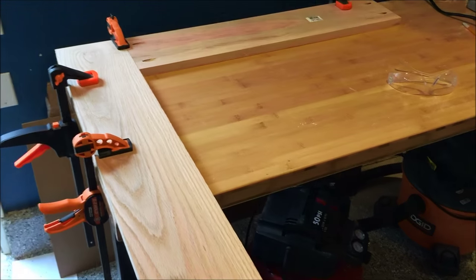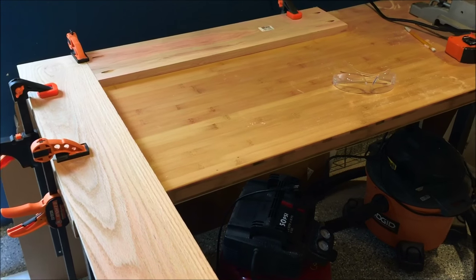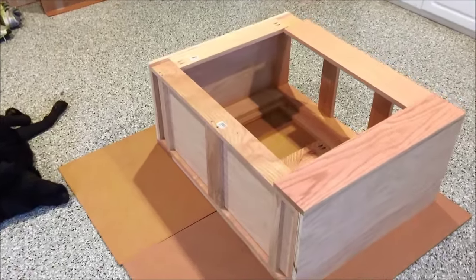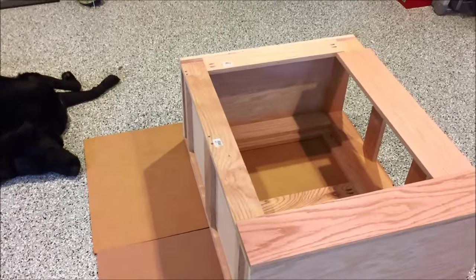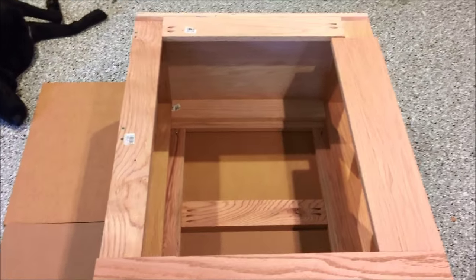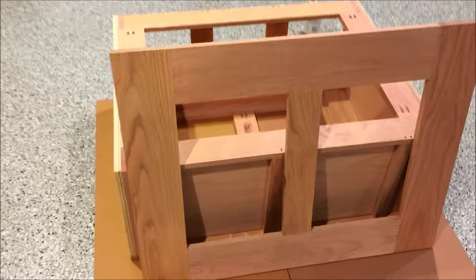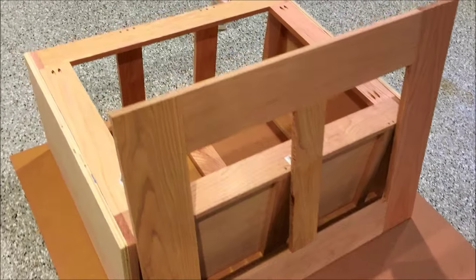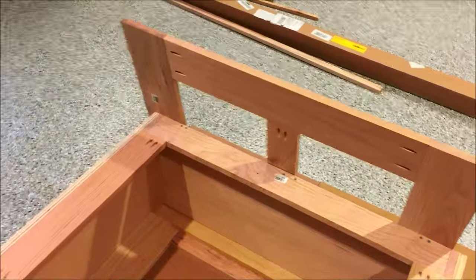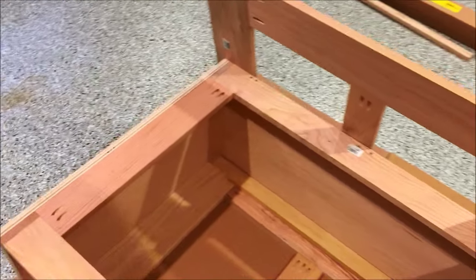I'm doing a dry clamp method — I'll get three pieces assembled together, then clamp them down inside for about a day and a half to two days to let them rewarp and reform a little before putting the final piece together. It worked really well for the front side. Here is the panel assembled — nice clean finish on the outside edge, and the inside is all joined together with pocket holes, which won't be visible once attached to the frame.